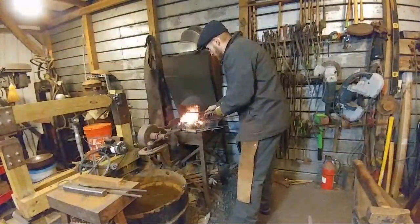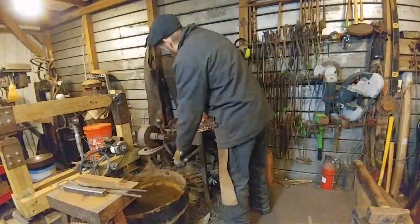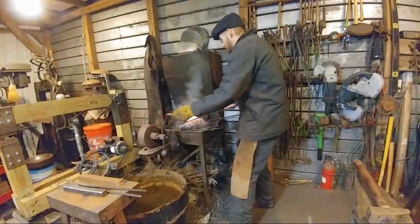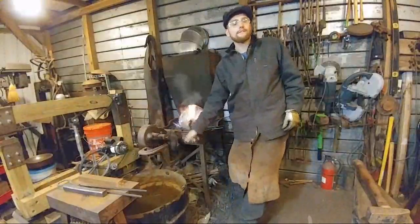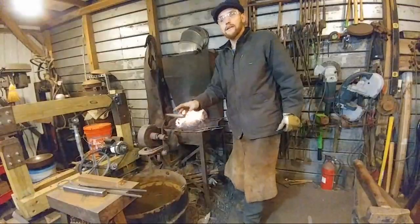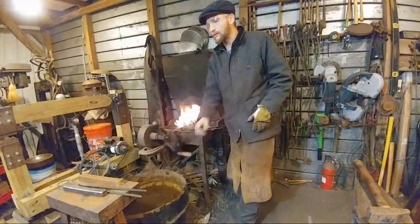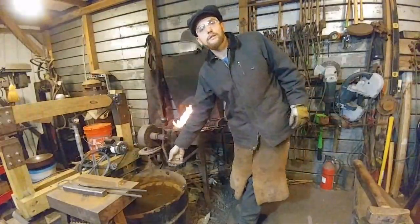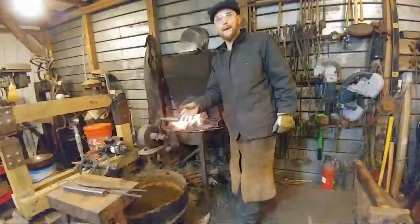Sarah and Mike G. ever forged an anvil from railroad track and rehardened it? I've never forged an anvil from railroad track. I have made it from I-beam. And to the best of my knowledge, railroad track is not hardened. It's meant to be a tough steel, not a brittle steel. So it's not that it can't harden. I won't get into that because I just don't know. But it's not hardened to start with. If anything, it gets work hardened by all the years of trains passing over it.